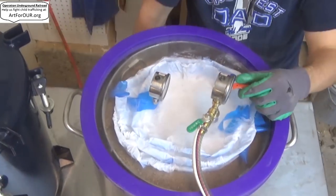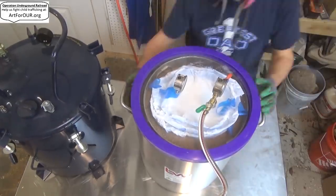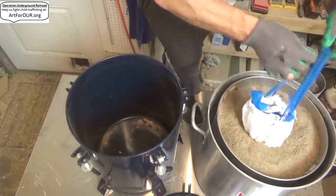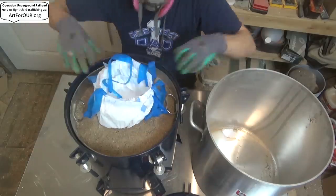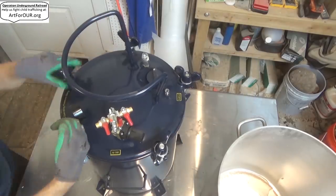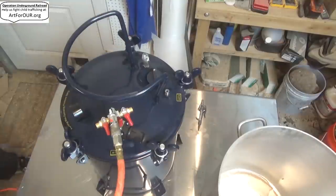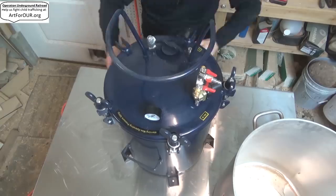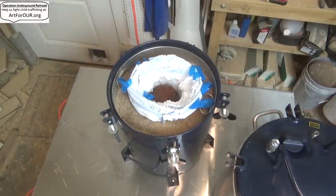And for some reason, the resin when it set got too hot and cracked. I'm not entirely sure why. All of the conditions were the same as projects I've used it before. Same manufacturer, same brand, everything. But for some reason this one got super hot and cracked, which is something I thought I had controlled with the type of resins I'm using and the thickness of the walls of the project. The only thing I can think of was this piece of wood was super porous, and so there was a lot more resin inside the wood after it ran through the vacuum chamber and the pressure pot, so the total volume was pretty high, and that itself may have just triggered an extremely high exothermic reaction,